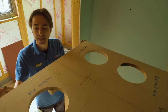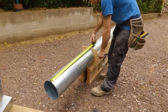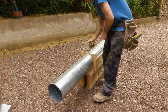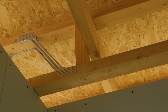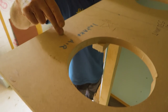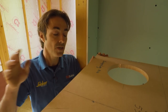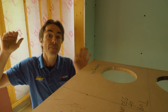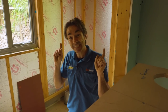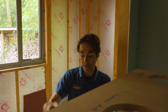What you see above me represents the top of the unit — it's a piece of MDF exactly to size. I've got four steel spiral ducts made by Lindab, 200 millimeters in diameter. Two of them go to the outside: one extracts stale air and one brings in fresh air. They all work in conjunction with the eco-joists. I've written on here the four airflow labels: extract air, exhaust air, intake air, and supply air. Supply air, for example, is the air that goes to all the habitable rooms.